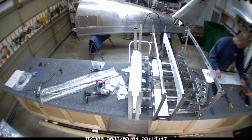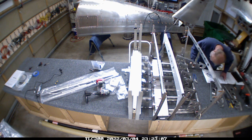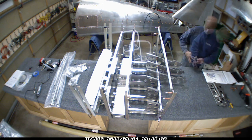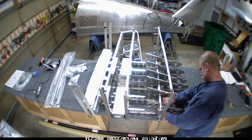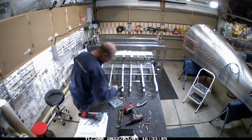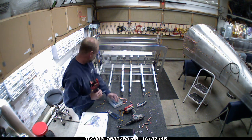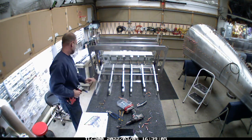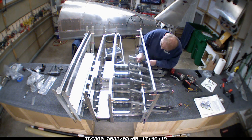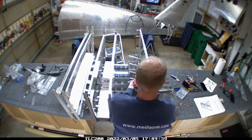What I'm working on here is the rest of the ribs for the rear portion of the main core portion of the fuselage. Just doing some dry fitting here because I hadn't actually cleaned or deburred them yet. I'm going to skip showing those parts of the video going forward because by now everybody's probably seen plenty of me removing the protective layer and then deburring and cleaning the ribs. Got all that done, went through and got it all riveted in — that's all together now.